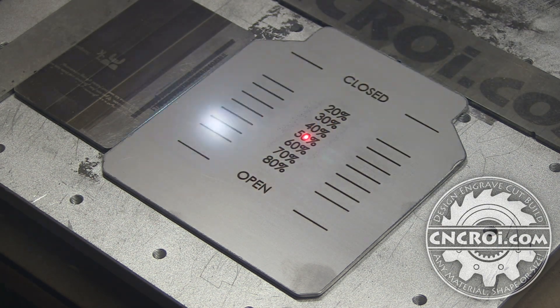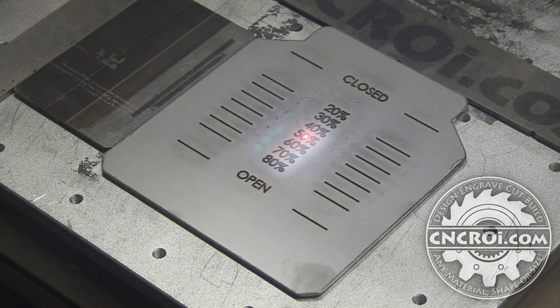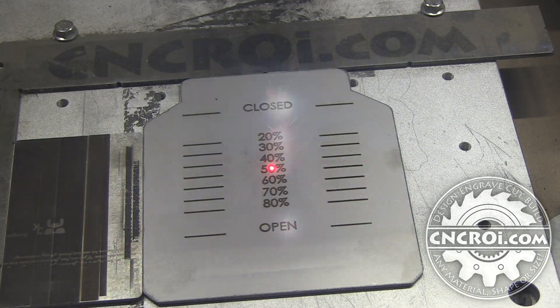This is not real time — it's done over the course of an entire hour or more. What you'll notice is it's actually carving into the stainless steel surface. If you look at around the end of each etching segment, you'll notice a little bit of dirt that builds up on the surface. That dirt is actually tiny bits and chunks of stainless steel that get vaporized and extracted from the surface.